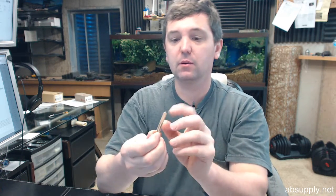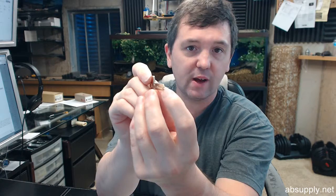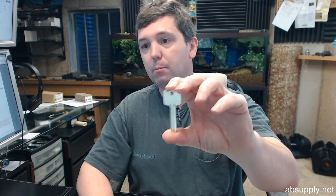The 1D is the keyway, which is a standard Aero keyway. The CH stands for the fact that this is a key blank that does not feature a hole. There's no hole drilled down in the tip of the key blank. Part of the possibility of the PointFlex system allows for the construction of the cylinder to have a long, thin barb through it.